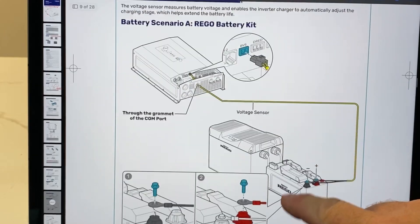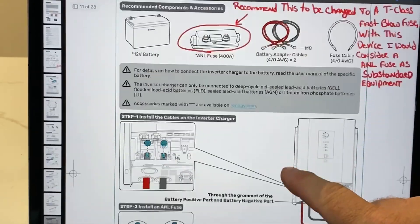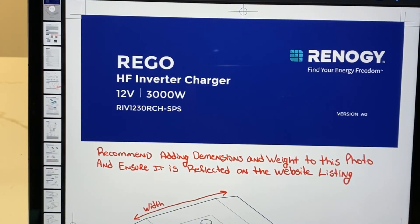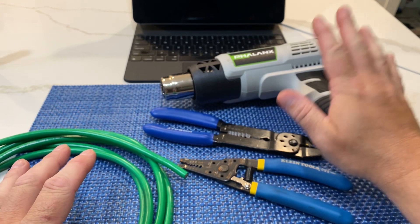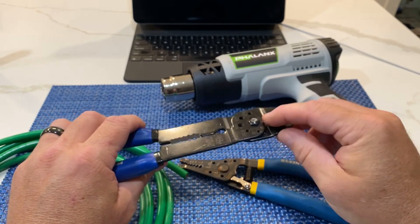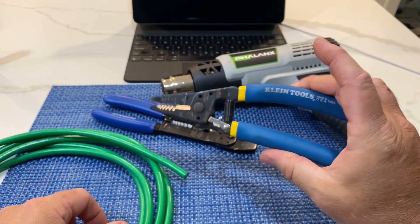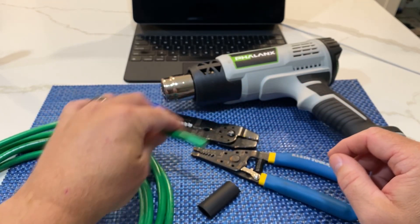I'll do a quick scan through a few other things the new inverter charger manual covers. Now I'm going to make this cable so you guys can watch, then we'll get out and install it on the new component. First thing - lay out everything. This is a standard heat gun; I'll put a link below. A set of crimpers - you don't need fancy ones, this is a good cheap set. A nice set of wire strippers - I use the Klein strippers, I'm not sponsored but these are a good tool. Make sure you have your cable ready.